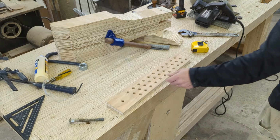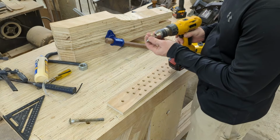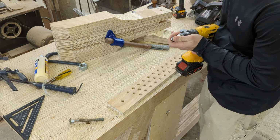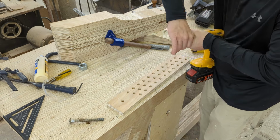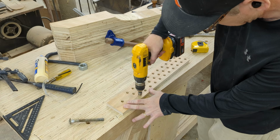This pin board has holes drilled through it in a pattern that allows 1/2-inch increments for the full length of the vise screw. This pattern allows for a maximum of 1/4-inch variance across the 23-inch height of the top of the vise jaw and the bottom.